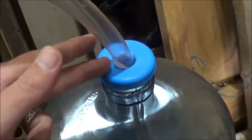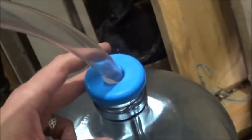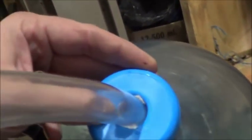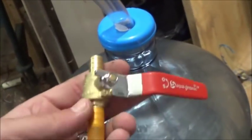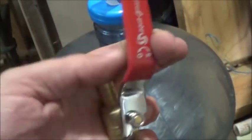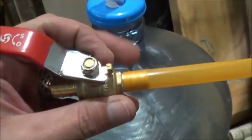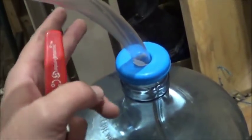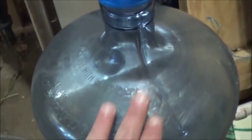On this one I've gotten started, you can see how I intend to do my methane collection. With these water bottles, if you just push that little center piece out, this three-quarter inch clear tubing fits right in there, nice and snug. I'm going to put a bead of liquid rubber around that to ensure it is gas tight. Then I've got a valve here connected to a straw temporarily — that's not actually going to be part of my system. I wanted to find the diameter I was looking for for the pipe exiting this, and I can take this straw to the hardware shop and be good to go.